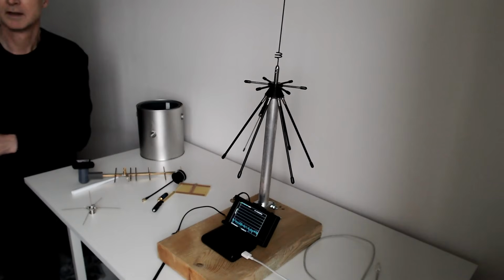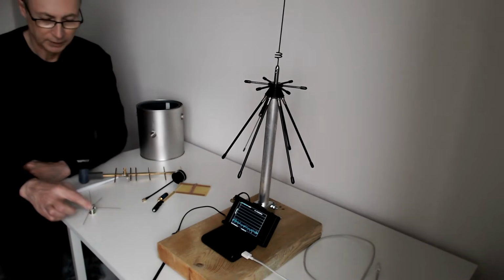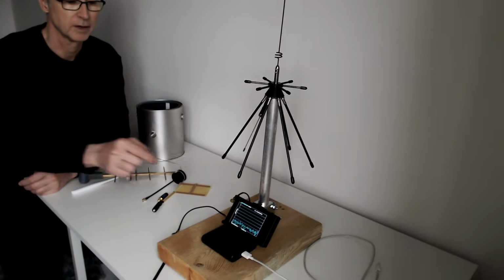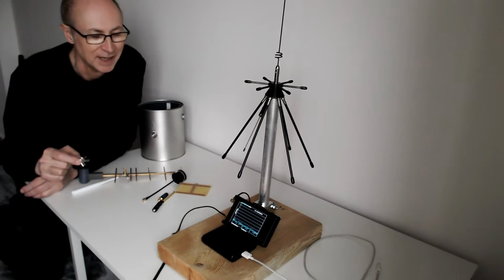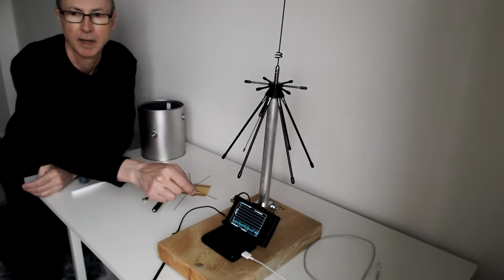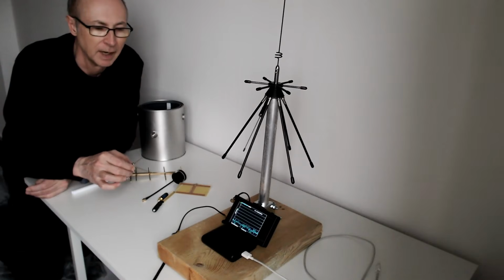So what I'm going to do next is to connect these antennas to the other end of the coax, the receiving end, and then the signal will come back here to be measured. Problem is, from the other side of the room I can't see the screen on the VNA. If I'm using a spectrum analyzer, unfortunately mine only goes up to 1 gig, not 1.2, or it's 900 megs. Then what can be used on the spectrum analyzer, you can switch on a big display, big numbers you can read from a distance away of loss in dBs.